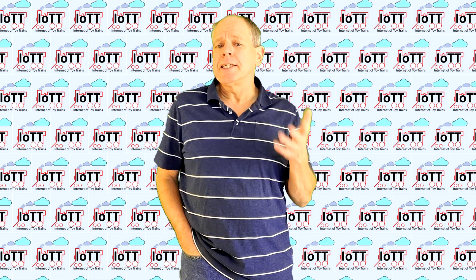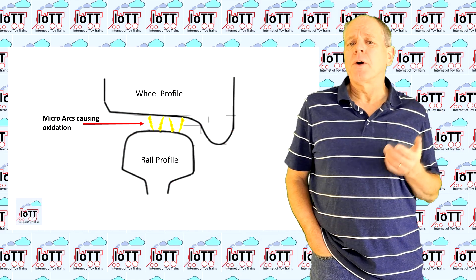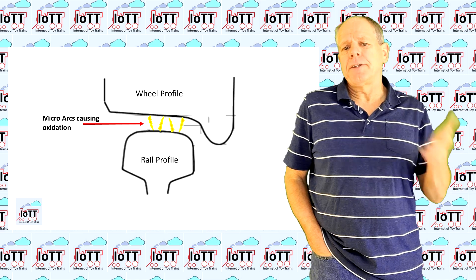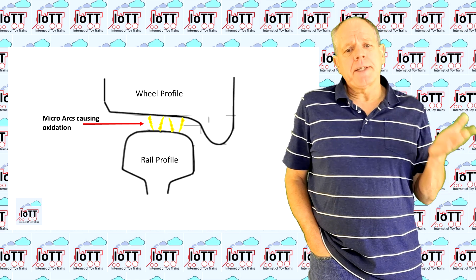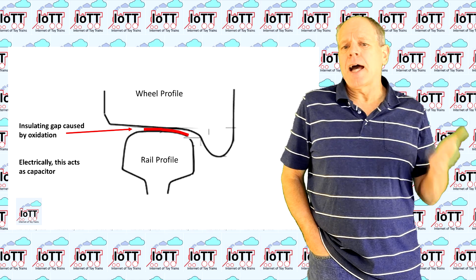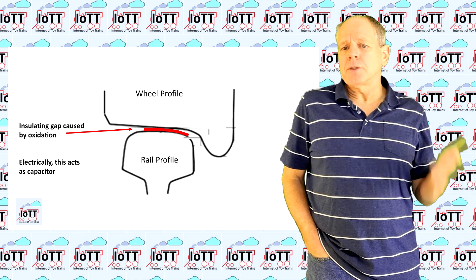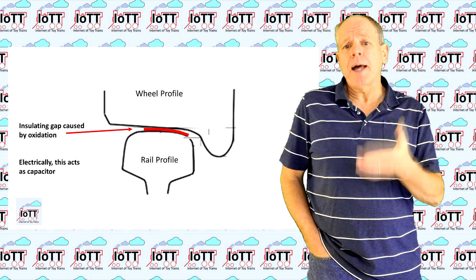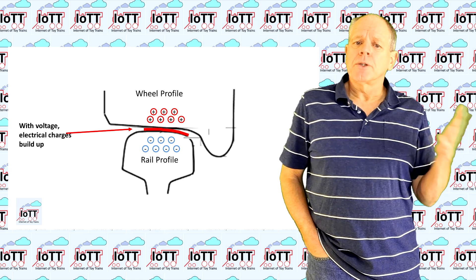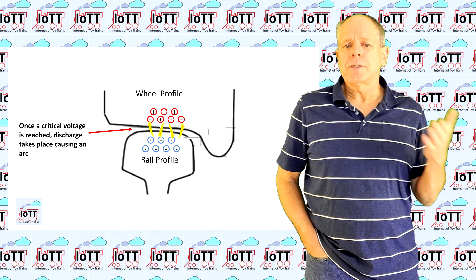Here is the explanation for why this is the right way to evaluate chemicals. Track oxidation is mainly caused by micro-arcing — very small and invisible sparks that discharge between the rail and the wheel. Every time the wheel is not in firm contact with the rail surface, it is electrically isolated and the current does not start to flow right away. In this situation, the wheel, together with the rail, starts to act as a capacitor. There is an electrical charge developing between the rail and the wheel.